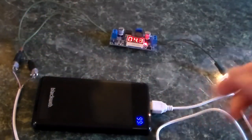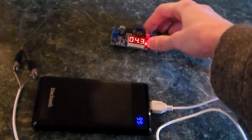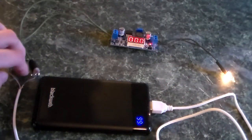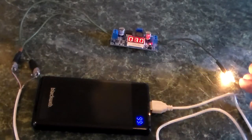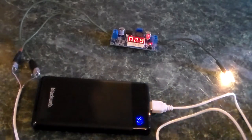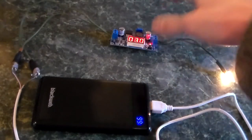Let's test out the modes if this board will stay active. As you can see I am putting three volts into this little 2.4-volt Christmas LED. It's a little bit high but it shouldn't hurt it at all, and I quite like it when it's a little brighter. If it ever burns out I have a whole string of these that went bad so I can easily replace the bulb. As you can see it's working fairly well. I'm not going to change the potentiometer, but trust me it does work. No matter how hard you try, you cannot boost this thing past the voltage going in.